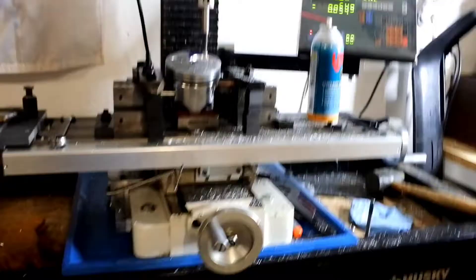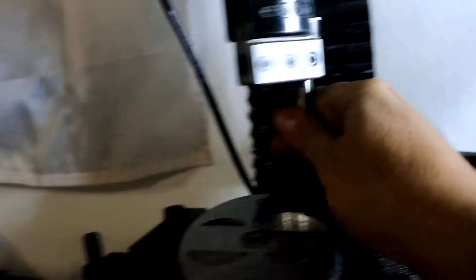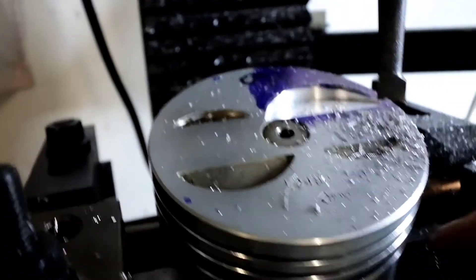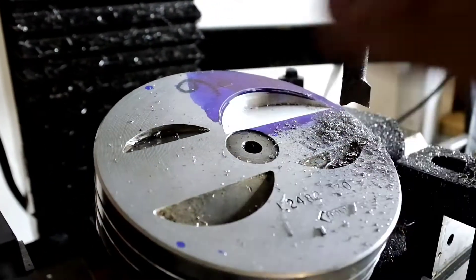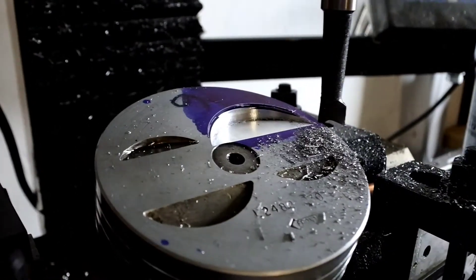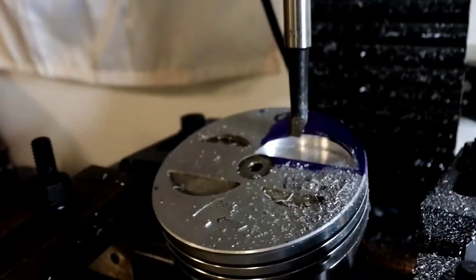I have a little milling machine here — a Precision Matthews PM25MV. I can't say enough good things. If you're going to buy a Chinese tool, look at Precision Matthews. They've got great quality control, extra steps, belt drives that are different, no plastic gears. Not sponsored, but hook me up. The mill is great. So here's what I'm setting up — this is a Criterion boring head. I put the valve further away from where it'll depress into the piston, and I set the boring head to that. That way I've got plenty of radial clearance.